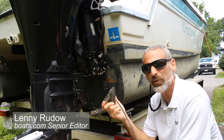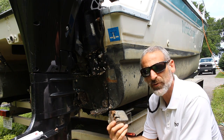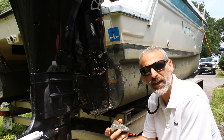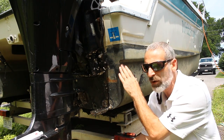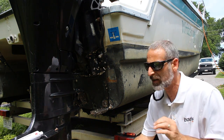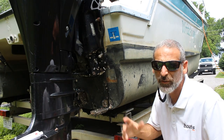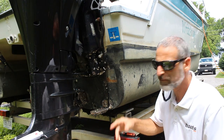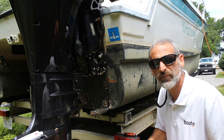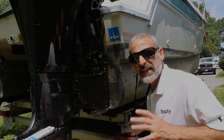The other day my old underwater lights broke off the transom. Evidently I violated one of my own personal rules — when I mounted these I used the hardware that came with the lights. Normally I'd throw away the hardware that comes with anything going below the waterline to be absolutely sure it's 316L grade stainless steel. These have been on for about 10 years, but the screws just melted away. The light got all chewed up as the bow was running, so now I need to patch these screw holes.